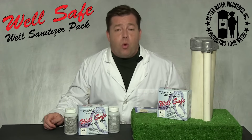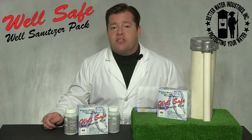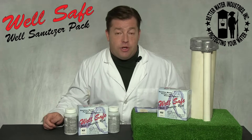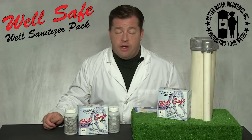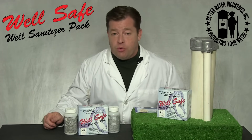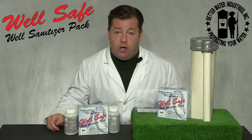In some rare instances, wells with a large amount of buildup or oxidized particles may experience pump blockage. If water flow is reduced, turn off power to the pump and clear the pump filter screen. Then re-engage power and resume pumping. Do not continue to run the pump if water does not flow.